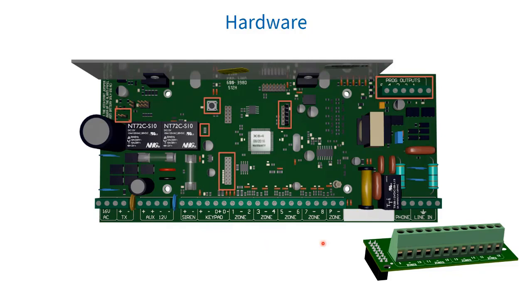We start off with the Kickstart Jumper. When connecting to a battery without 16 volt AC connected, the X-Series alarm panel will not power up until the Kickstart Jumper has been shorted. This feature ensures that if the battery voltage starts fluctuating and goes below 10.5 volts without AC, the panel switches off, stopping the alarm from entering undesirable states that could compromise system integrity. When AC is applied, the alarm will power up automatically.